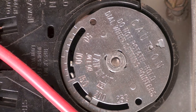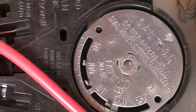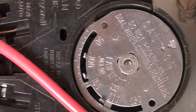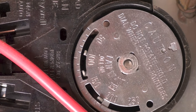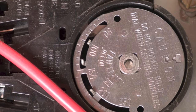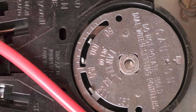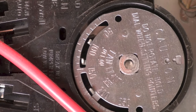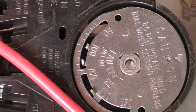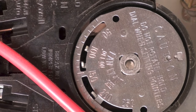Now I've reset the temperature to 130 on and 100 off. Let's see how it operates. It's going up, just turned on, and it looks like it's going to continue going up a little bit. Now it's settling down because the heat exchanger is warming up, allowing the fan to stay on continuously.